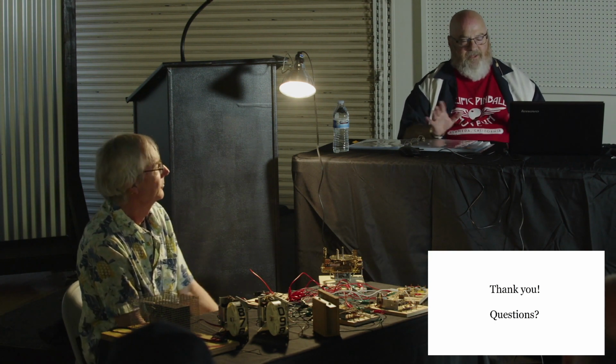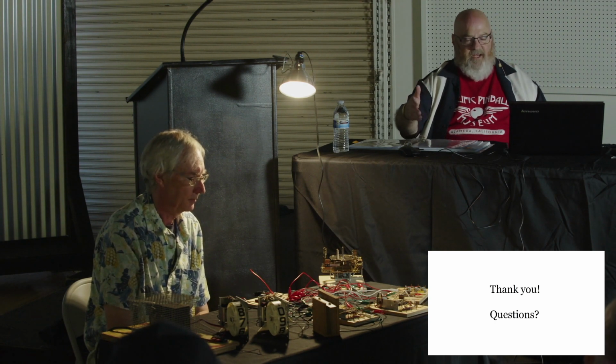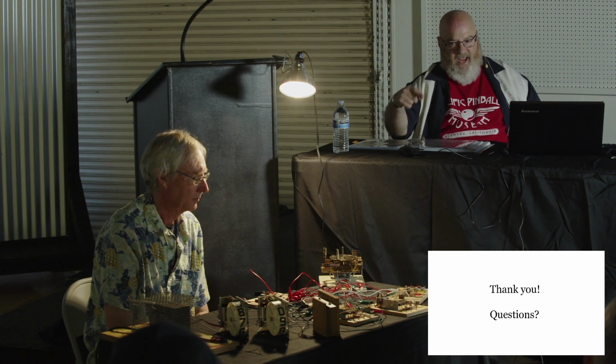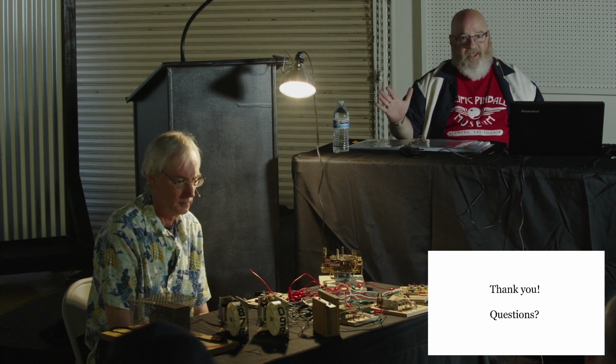I'm not sure I totally understand the question, but let me see if I can get it. So first of all, for the lowest denomination digit, which I think is what we're kind of talking about, throughout the game, until you're getting into the replay scores, it doesn't matter what number is showing. The game operates exactly the same, regardless of what number is showing. If you have a wiper on the disc, it actually has a circuit that will identify each digit, but that's only used on the lowest denomination ones for match. At the very end of the game, it wants to know what number is showing on that score reel. All throughout the game, it does not care.